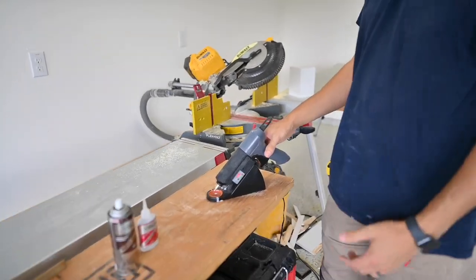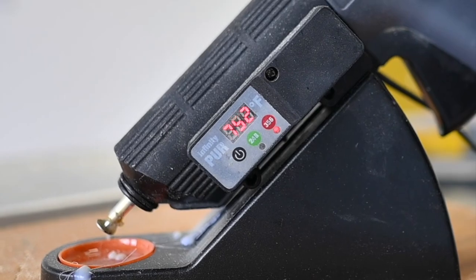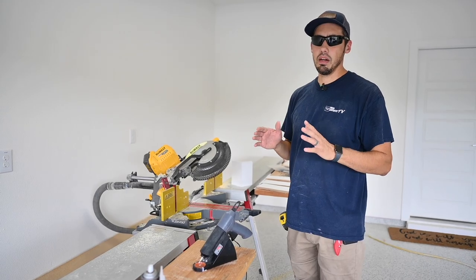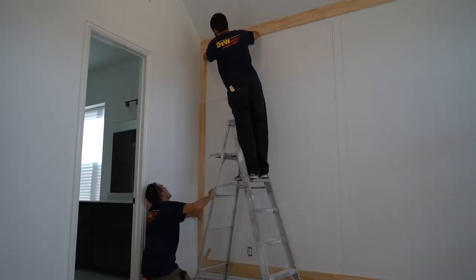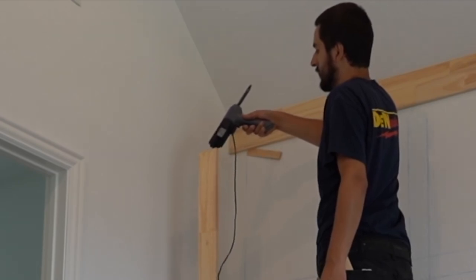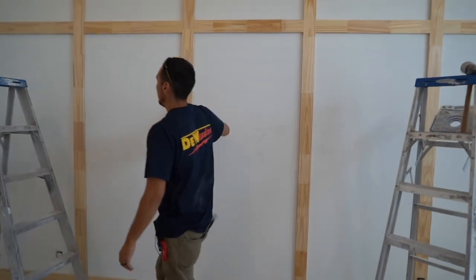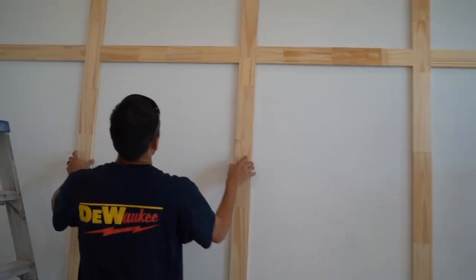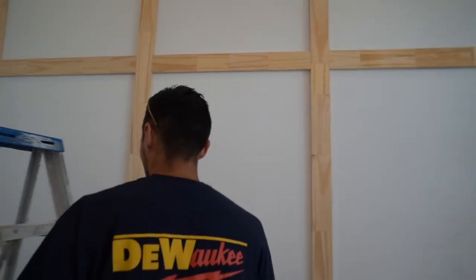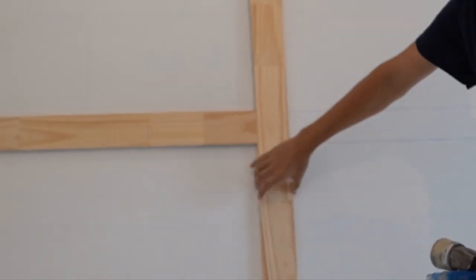Now this pure is PUR and it stands for polyurethane reactive. We've been using this stuff for about a year and a half. The first time I used it, I was very impressed. We did an accent wall — a grid accent wall with styles and rails going in all directions. We used this glue on those joints where the styles and rails met up, and you can see from that video I'm pulling on it and it's almost like it's pocket screwed together. About a minute or two — and that's pretty crazy guys.